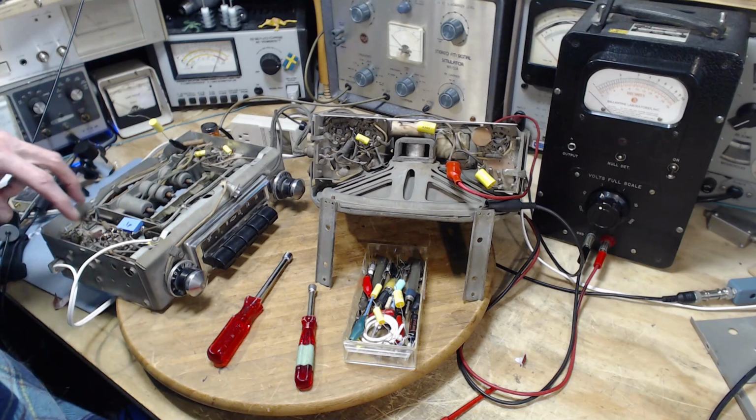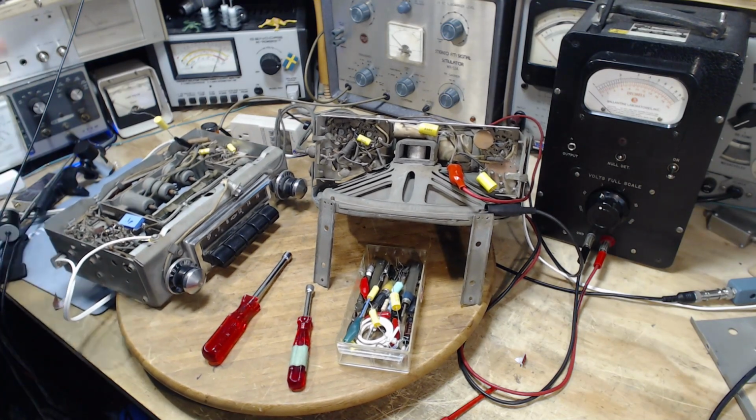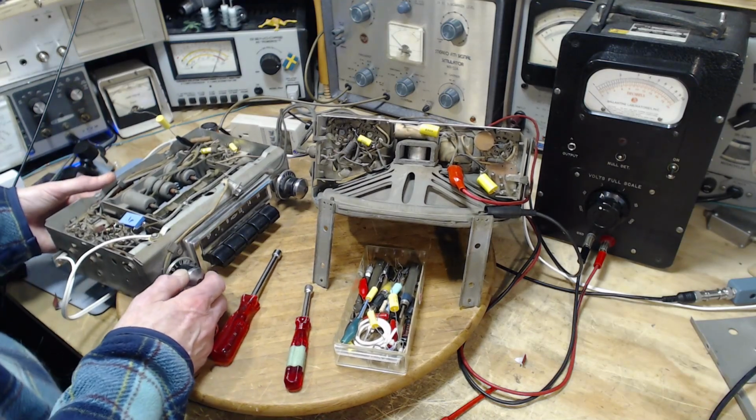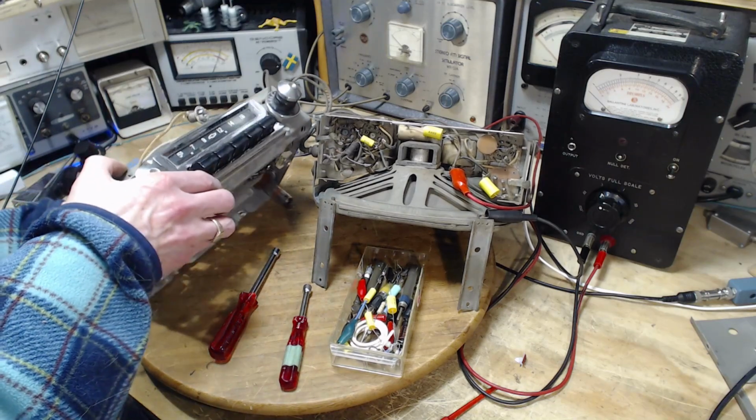and then I'll be making adjustments to the IF cans. They're both here. They have to be done from below and from above, or is it the other way around? It's the other way around. This is from above and from below, so I have to be able to access the radio. This can easily stand up on its end here, actually. I'd rather do that now than when the radio's operating.